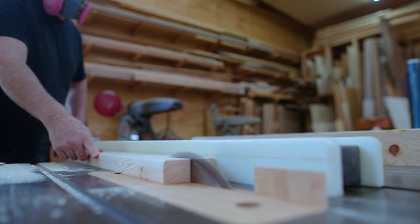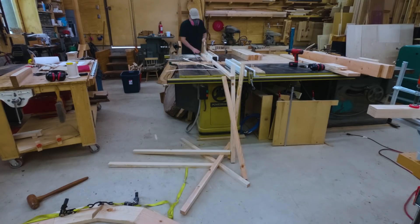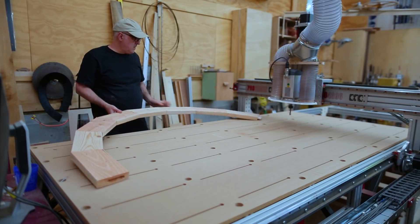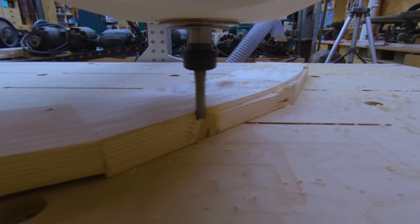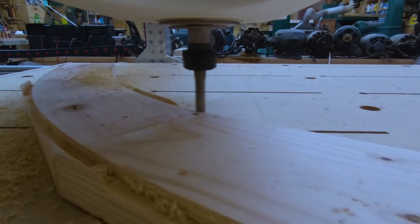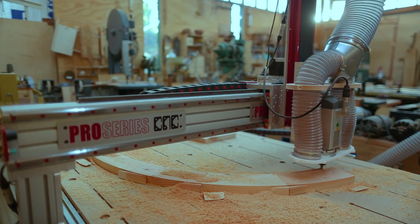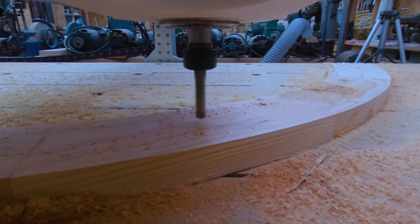As the glue set up on the ring, I cut the strips for the cross pieces by ripping two-by-fours in half, making lots and lots of sticks. Then I took my two arches apart — that worked. I wanted to cut the actual curve of the arch into the segmented piece and cut off the points, so I screwed the arch down to the CNC table and cut the arch shape. Once that was set up and cut, doing the mortises for the cross pieces was straightforward.